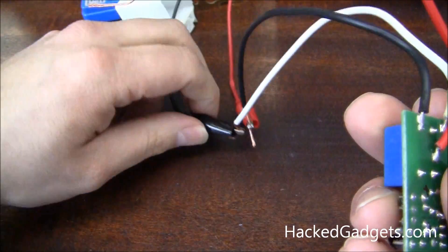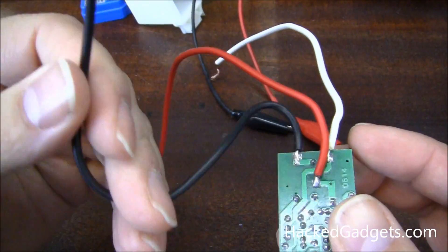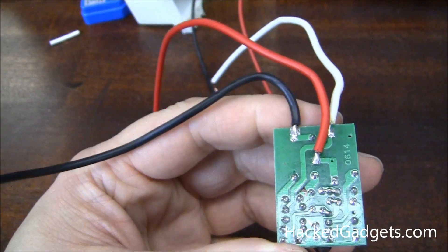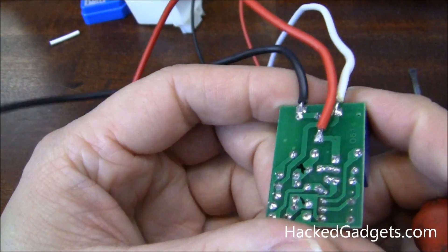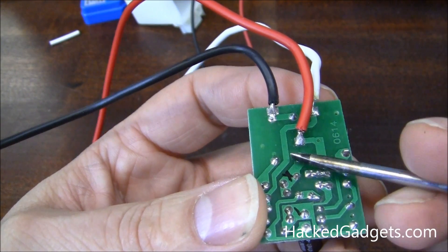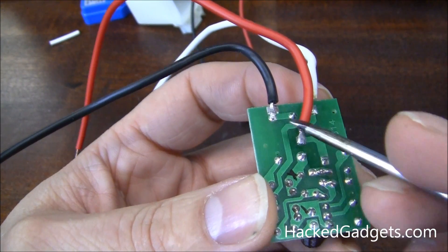So here is sort of how it's wired up, looking at it in DC operation. This would be positive in. And on the opposite side here, there's the relay. Here are your relay coils. When this is energized — and this is obviously a DC coil — this is your common here. And this pin here is your normally open. So this will get shorted out when the relay is activated.